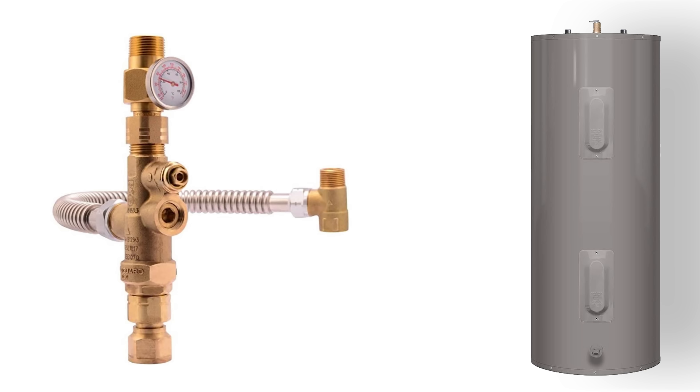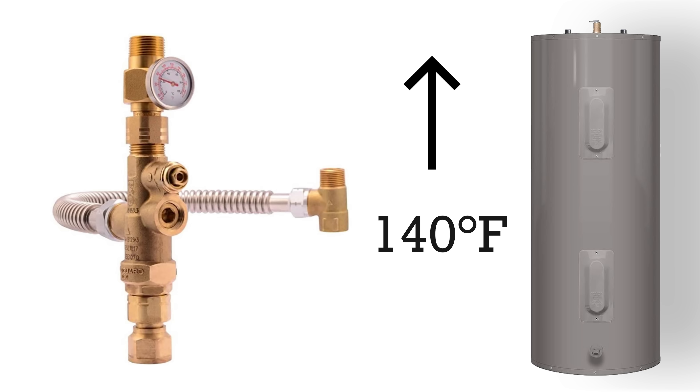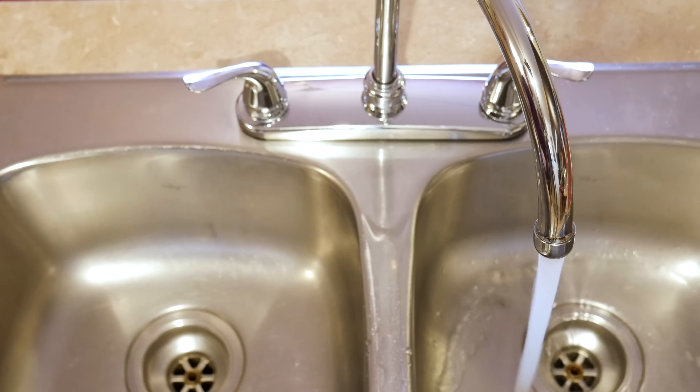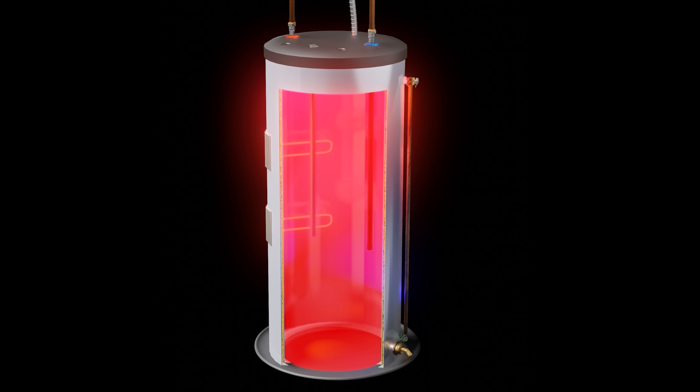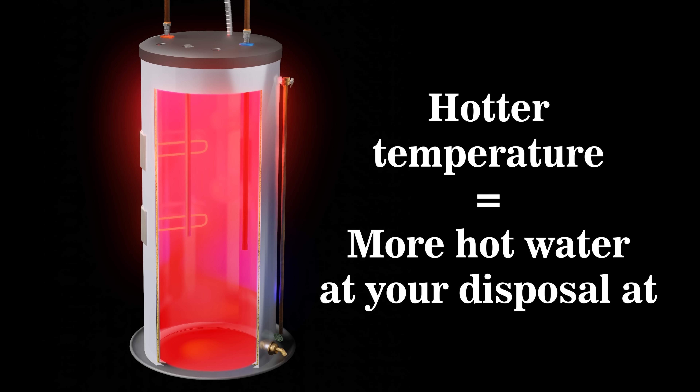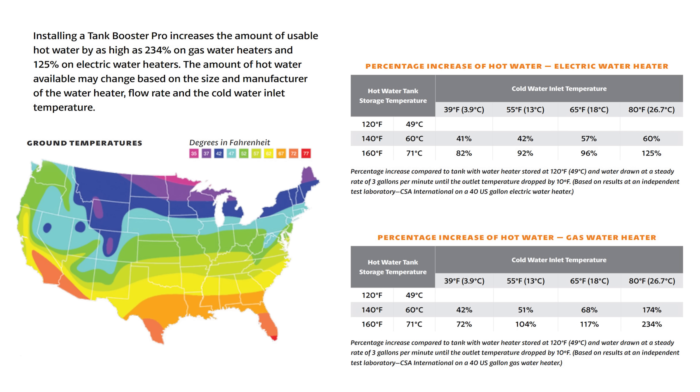The other model works in a different way. It requires the tank's temperature to be raised to 140 degrees Fahrenheit and is then mixed with the cold water, which in turn doesn't use up as much hot water. You're probably asking yourself, why not just control the water at the fixture instead of using a mixing valve? It's quite simple. If the water heater empties itself of hot water and fills up with cold domestic water every time, the energy required to heat it back up to temperature is greater than if it was maintained at a hotter temperature. That's what this valve does — it keeps the inside of the tank at a hotter temperature, allowing for a lot more hot water at your disposal. There's also a nice chart on Cash Acme's website showing all the potential gains depending on what type of heater you have and the temperature of your domestic water.